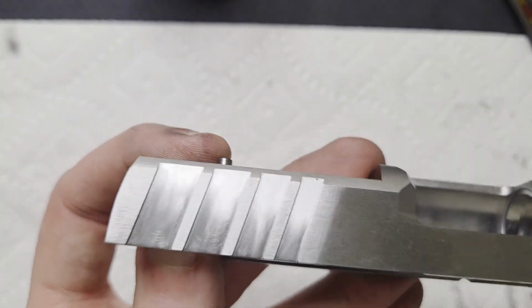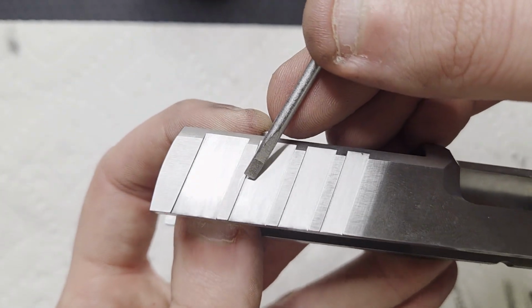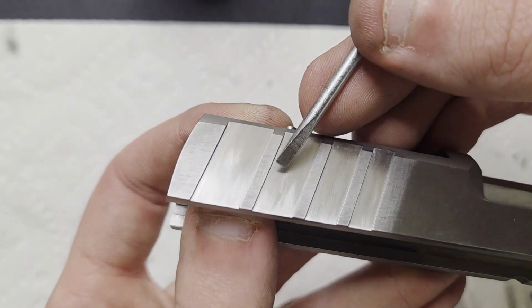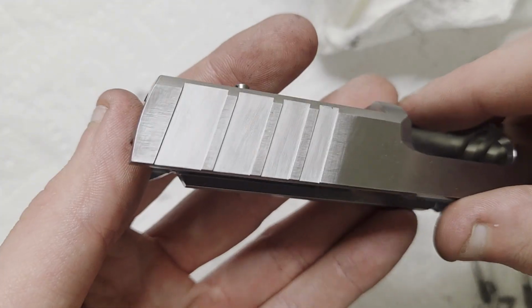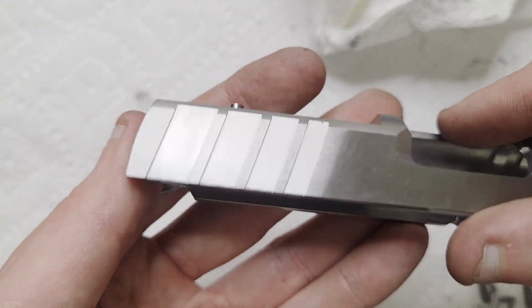On one of the rear serrations, I touched off in the wrong location. I am quite dyslexic and read my drawing wrong, so I dialed my location as 4.962 instead of 4.926. I touched off in that location, but my dad caught it before I made the cut, thank God. So I had a little mark there, maybe 1 thou deep. It sanded out very easily.